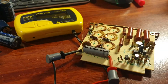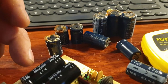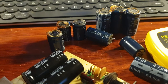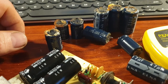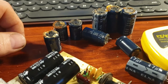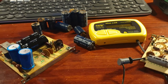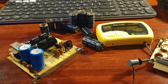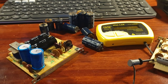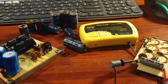This is just a little look at grotty old capacitors that can become a bit of a project to change out. When people talk about recapping radios, generally I'm not a big advocate for recapping everything for the sake of it. But high voltage stuff that's old — if it's above 250 volts and it's 50 years old, yeah, it's probably not a bad idea to put a few new ones in. 73s — sorry it's just a bit of a short video on caps. We'll do a run-up on that 902 when we get it all rebuilt and find out what else is going on with it. So far just lots of smoke — we'll try and get a bit of a better result. 73s, all the best, VK3 Charlie Mike, Tanga and Malanga, North East Victoria.